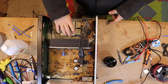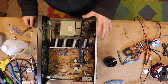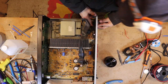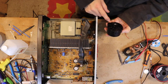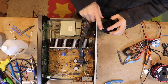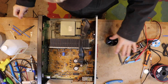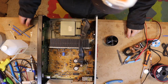So I need to get at that piece. I had to take the whole transformer off - I don't like touching this stuff if I don't have to - and move things around carefully. I had to take this piece off down here, slid it out, pulled this out, had to undo a bunch of stuff. Got to this connector and it was pretty corroded looking, and this was also pretty nasty, so I put DeoxIT all over it. I actually soldered some wires on here in my testing phase.